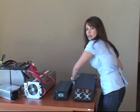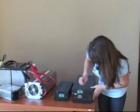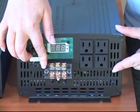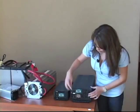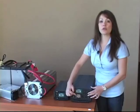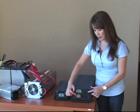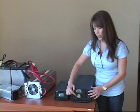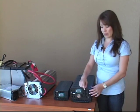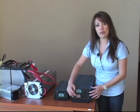I'm going to turn an inverter around so you can see the front panel. As you can see, this inverter comes with four outlets. It has a display panel that measures battery voltage and percent load. It also has an AC direct connect terminal block. This is a nice feature because if you need to pull more than 1500 watts of power out of one outlet, you will direct connect to this terminal block. UL strongly recommends that you only pull 1500 watts out of each outlet.